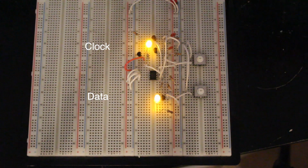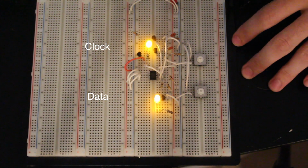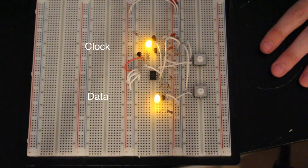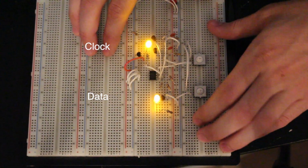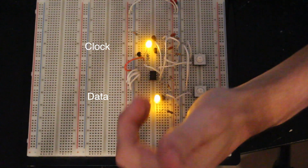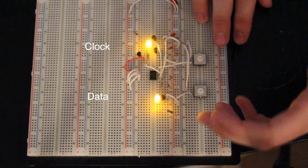I've looked at some of the other data sheets. They're all kind of the same thing, but after you write the device address, the data you write to and from the device depends on the device and what you're doing with it. But in this case, it's very simple, straightforward I2C stuff. And it does have to be in a protocol. This is always the same for all of the I2C devices, because otherwise they couldn't sell the devices, because you connect all of these to the same 2 wires, okay? So even if I had other devices here, they would all have to follow this same protocol.